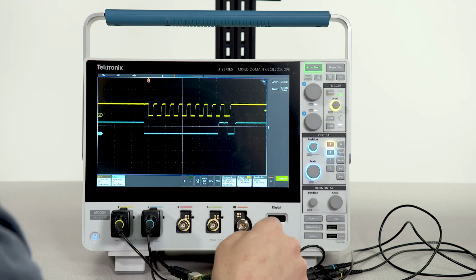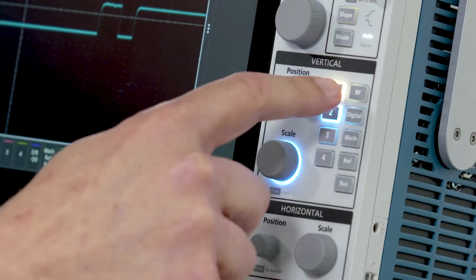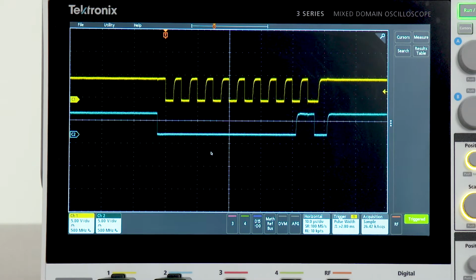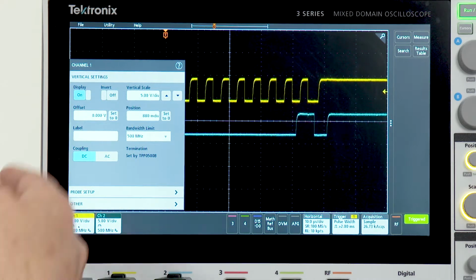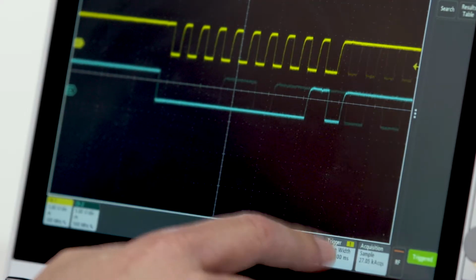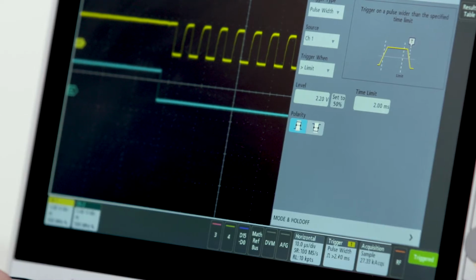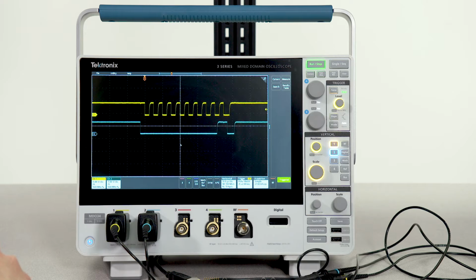Traditional knobs provide control for important settings, while LEDs indicate which source the knobs are assigned to. Whatever object you want to adjust, you simply double tap its object on the display. For example, here is all of my channel 1 settings, or I could change my trigger settings. Simply double tap on them to get the menu. When you're done, touch anywhere outside to dismiss the menu.